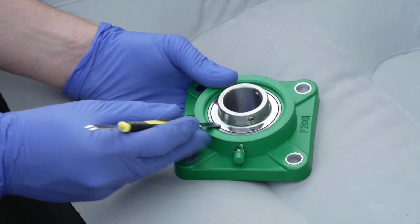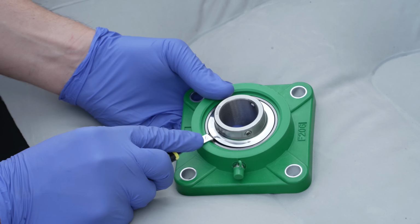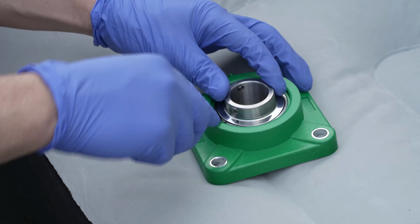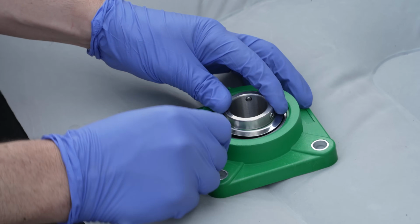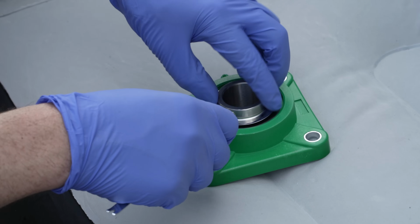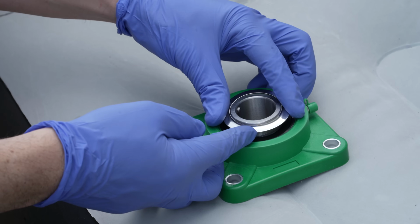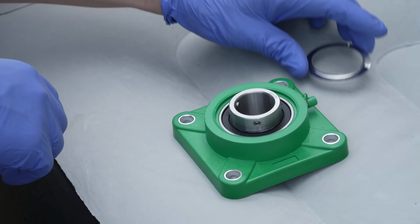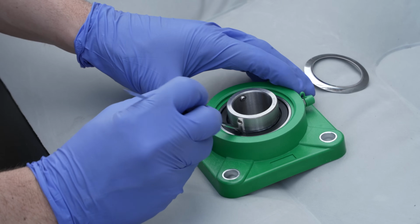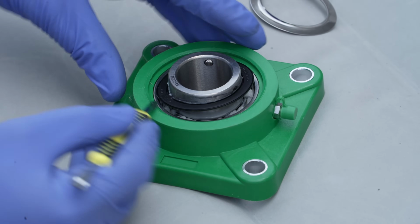I have some small prying tools, but even they were too thick, so I filed one even narrower yet without making it dangerously sharp. These bearings have a stainless steel shield, and they are thin, so instead of prying it off crudely in one motion, I needed to ease it off to avoid bending the steel. But that's only in the way to stop impacts or large debris from attacking the nitrile rubber seal. I had to be really careful here and used a longer and pointier prying tool. Going in via the inner perimeter, sideways and not perpendicular to the edge of the seal, seemed the gentlest method.